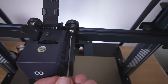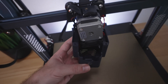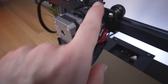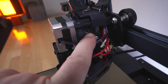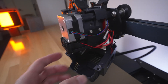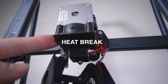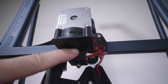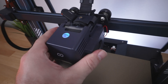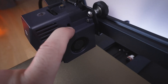There are a couple of bolts we can loosen and the whole extruder piece comes out. You can see a little better what's inside — the extruder motor, the extruder mechanism, and that little bolt is the tensioner. There's a small board in the back with a bunch of wiring. Underneath, this is the axial parts cooling fan, which is quite large, and then the two parts cooling fans inside the shroud. Very nice build quality and attention to detail. You can access that adjusting bolt through this hole.